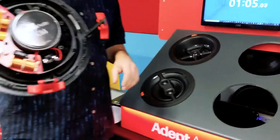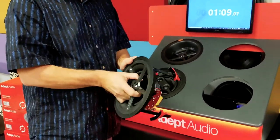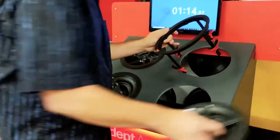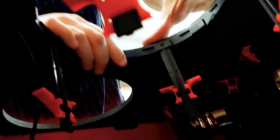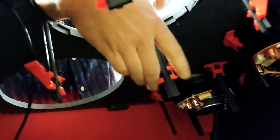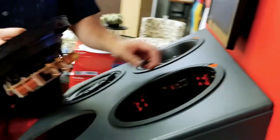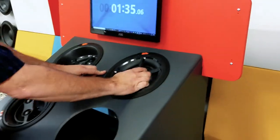This is the IC66 speaker. We can take this, turning the trim ring counterclockwise, putting this into the opening. As you can see up inside here, you can take these brackets, squeeze them against your drywall, masonite, any other material. Put your speaker in place — up, twist, click and lock.